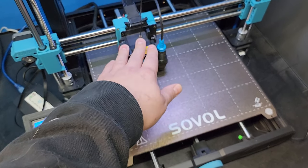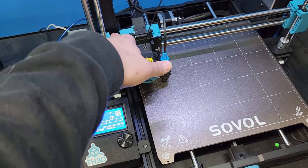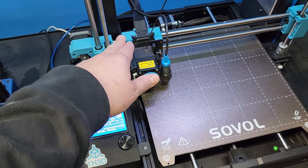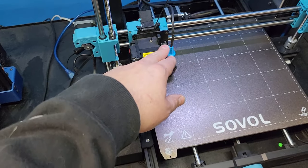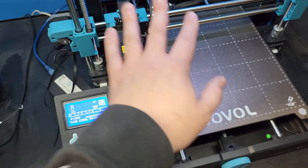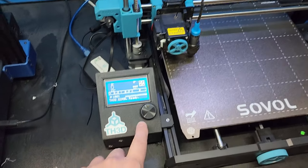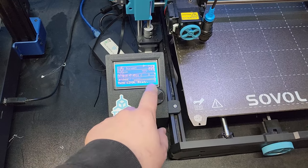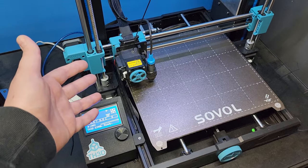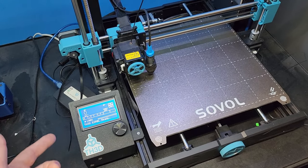If your machine is triggering before it actually gets to the travel position, you're going to want to lower the sensitivity a little bit. I would recommend going in increments of 5 to 10 until you find the value that actually works for your machine, and that'll work for any axis, whether it's the X or the Y. Once you find the value that works, you can go to the Configuration menu and select Store Settings. I hope this video helps you tune your sensorless homing settings on Unified 2 firmware.